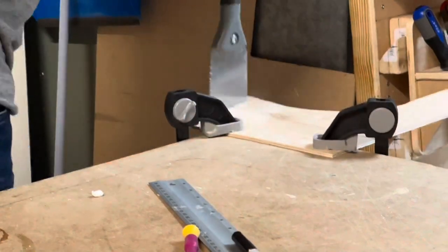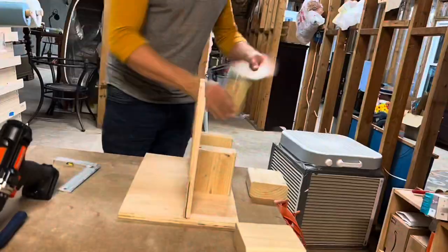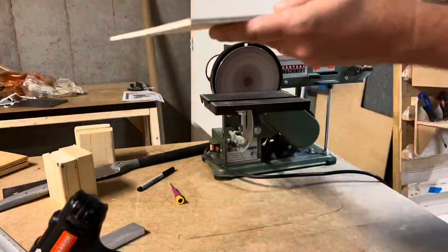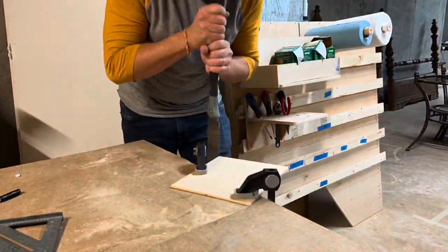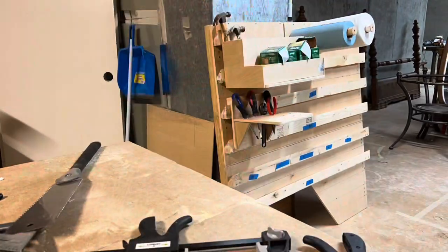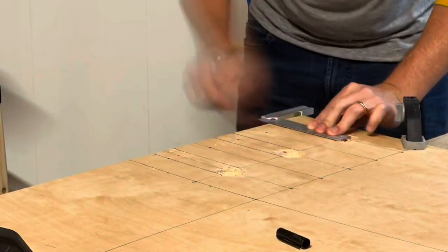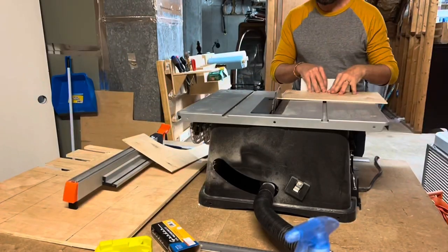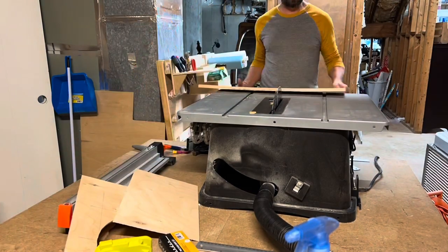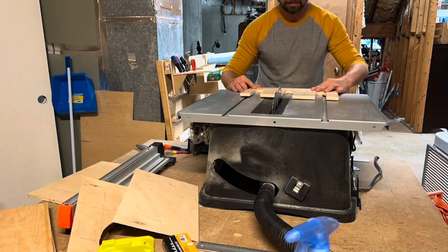The next component was the power drill holder. Early on in the design sessions, Reggaetron indicated he's got multiple drills and impact drivers, so I wanted to make sure he had a place to store them. I began by cutting the slats for the individual drills using five millimeter underlayment and gave them a curved top. On the outsides I cut a tapered angle down using the Japanese pull saw. For the receiving base I used a one and a half inch hole saw to cut three circles, then drew lines with a square where the drills were going to fit into those slots and cut them out with a jigsaw. After sanding down the rough edges I made the final cuts on the table saw, and this component was essentially done.